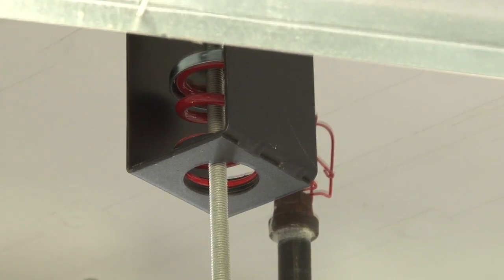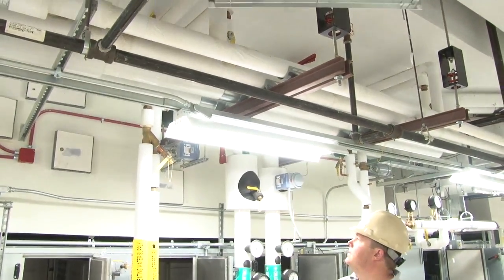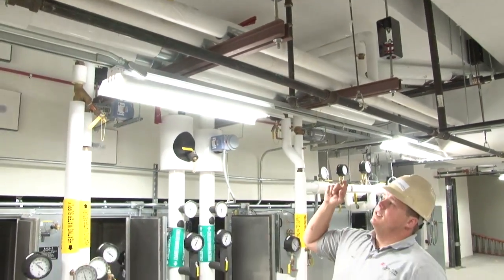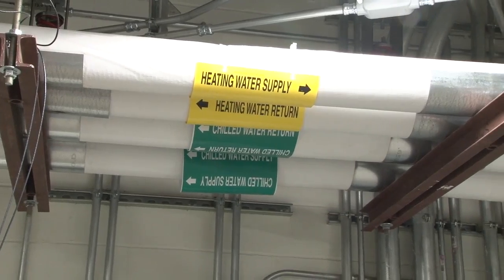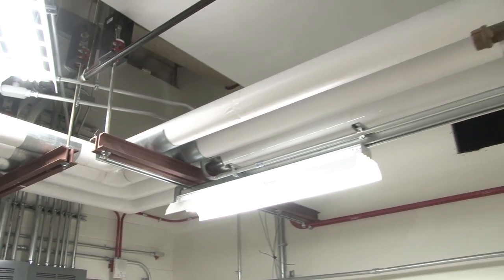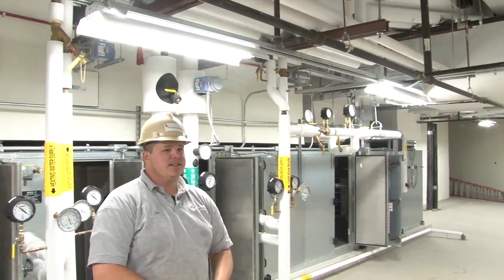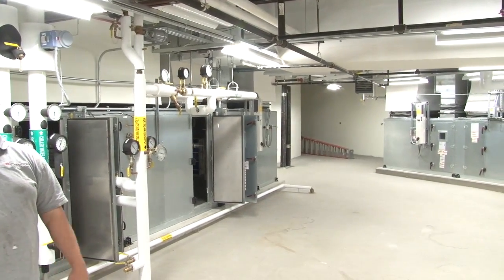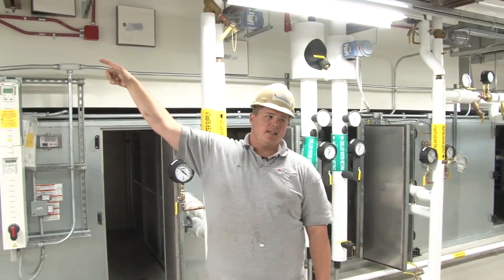As you can see up here, there are your shut-off valves as well, behind your balancing valves. Your ductwork comes up, and if you look down through here, this is the return line that comes off the back of the stage. It feeds from way over there, loops around, and goes down there. The reason for it is sound. They were able to get a sound attenuator in there. And then your supply fan supplies out the wall and down to the theater.